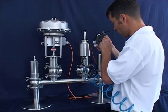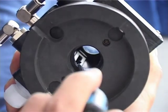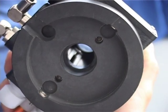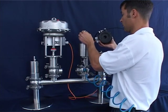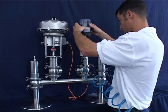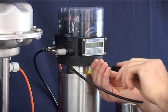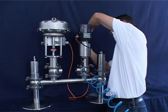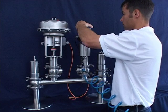Make sure that the guide pin of the path measuring system is in the uppermost position before mounting the TopControl. This will ensure you can easily lock the pin in the driver fork. Carefully mount the TopControl over the actuator stem and firmly press it down in the vertical direction. Use an Allen key to tighten the two fastening screws in the base of the TopControl. Turn the bayonet seal of the TopControl counterclockwise to the catch and pull off the cover upwards.